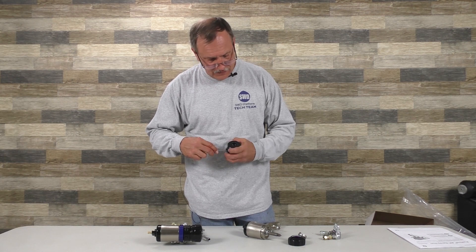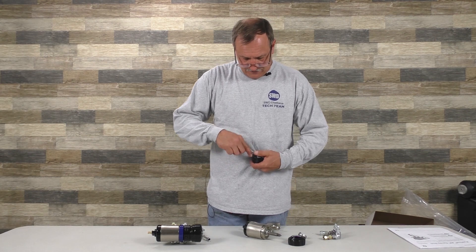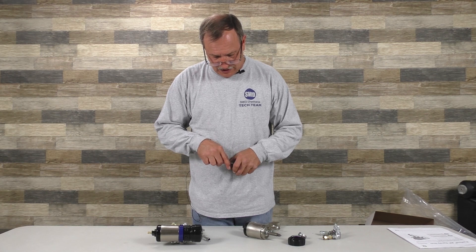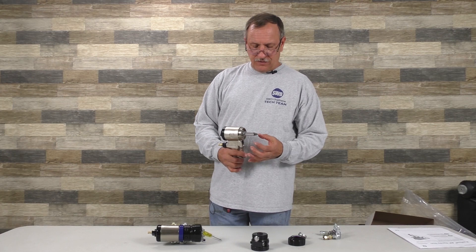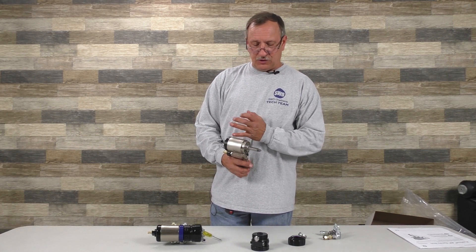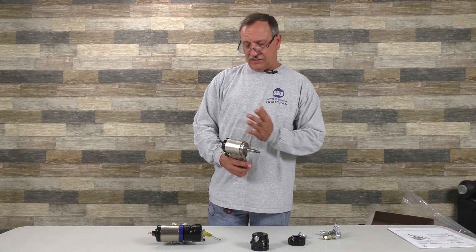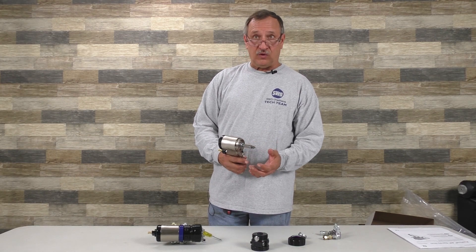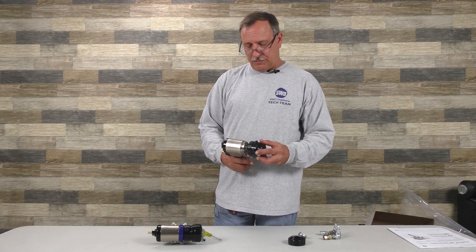The main issue I've seen with this gun is when it starts clicking, guys don't stop — they keep on spraying, and it causes more and more problems. Material builds around the mixing chamber, so it binds up. As it binds up, it takes more pressure to push the piston back. It may take 30 pounds of pressure and then all of a sudden it slams back. While that material is still built up, when you release the trigger it slams forward. That's what's causing the popping or clacking sound a lot of people hear.